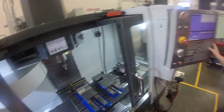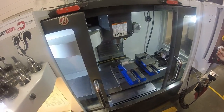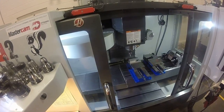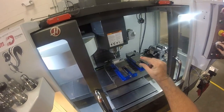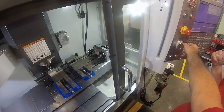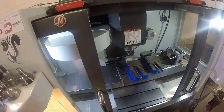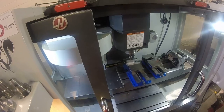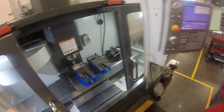You can do this with the doors open if you need a better look. Get it over the center of the part. We want to be about 3/8 tall, so bring it down some more. Instead of using this to crank, we convert to using the big knurled part. Get it more centered — visually centered is fine, this is just approximate. That spacing right here is what they were asking for — that 10 millimeters of space. Now we need to shut the door because we're going to run the program.